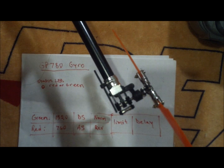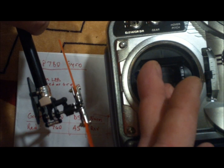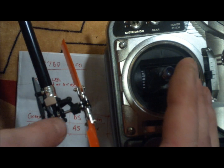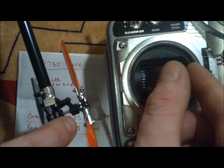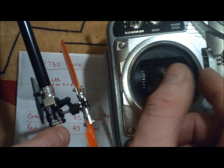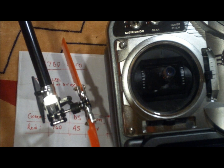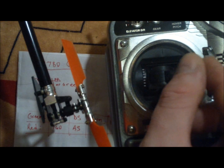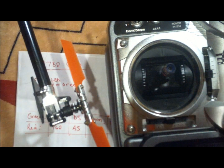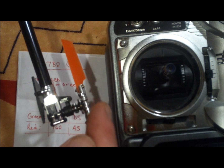Next is limit, so setting your limit. What you want to do is go to the limit setting, go all the way to the left, and push the slider out almost to where it reaches the end — almost touching — then back it off just a little bit so it doesn't bind. The status LED will eventually start blinking another color. Then go to the other side, go to the end, pull it back a little bit, and the status LED will flash green then red to confirm. That's showing the servo limits and how far it'll go in each direction.